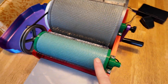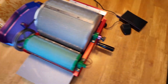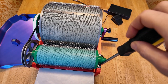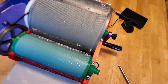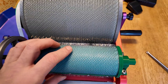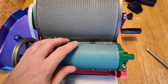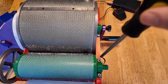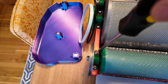This front licker drum does have slots here — you can't really see it — but you just loosen up these four screws. When you're aligning it, you probably want to remove this belt here, and then you just get it to the position you want. It goes way far away so it won't even come close to touching, or you can have it collide inward, so you pick some kind of in-between region. Once you find a spot you're pretty happy with, you just tighten these four screws and you've realigned that front drum.